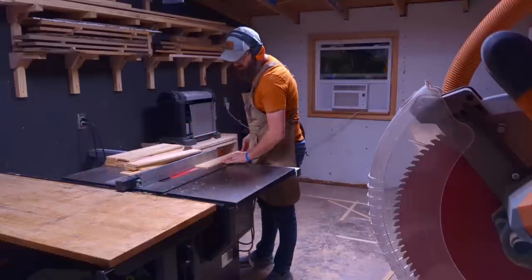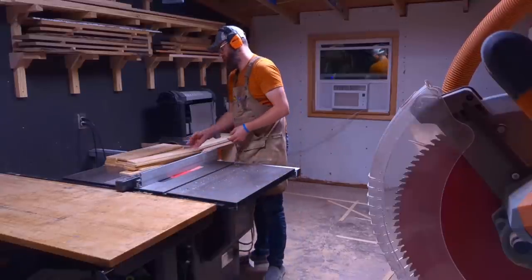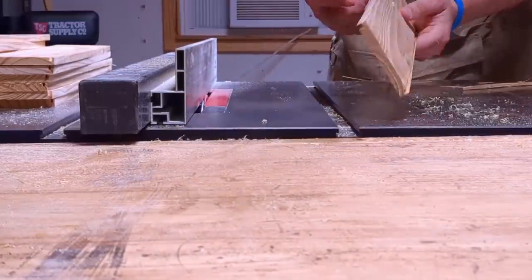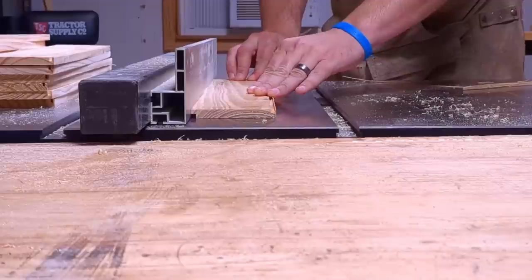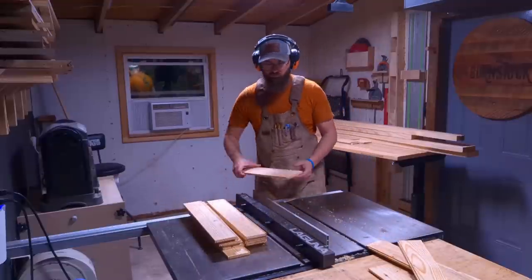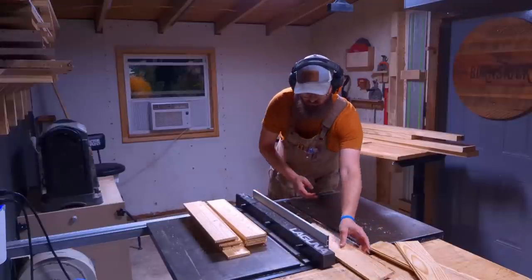I had to accommodate the aprons — I had to cut those down a little more off camera to make this planter box work. It just takes a couple passes. You slowly go towards that outside angle, and once you get to the end you can do a cope cut. You'll see where I shimmy it back and forth to take out that little bit that's left. That'll also smooth out all the grooves left by the Diablo blade — it cuts into a V groove, so you make that nice, smooth, and flat. It's easier with the dado stack, but it can be done without it.